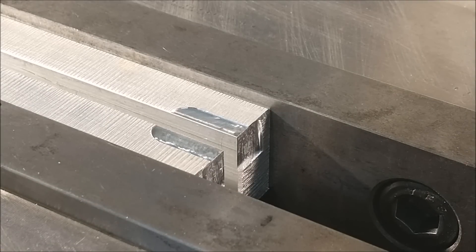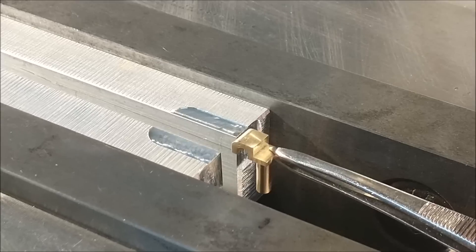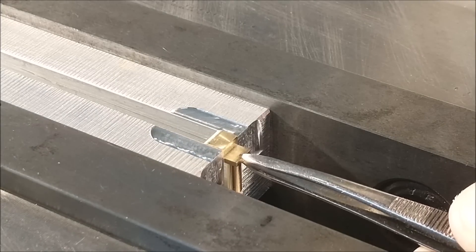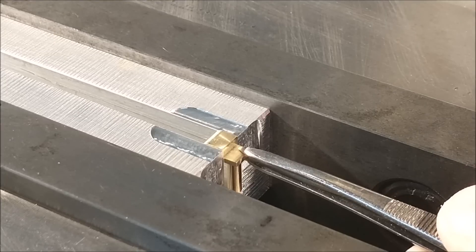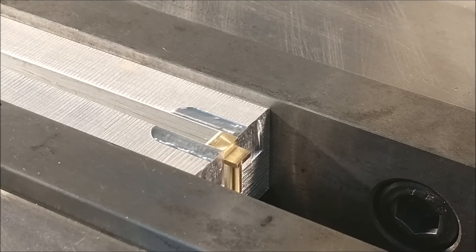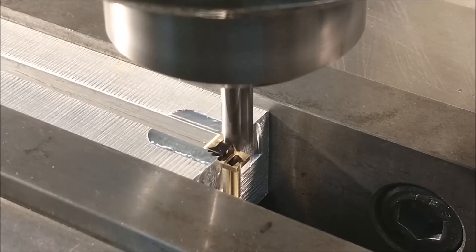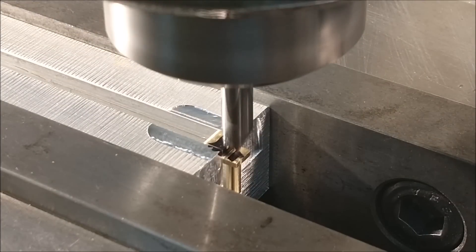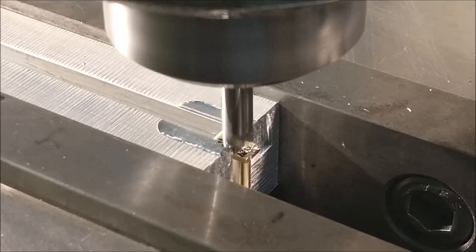This operation cannot be done on top of the jaws — all the work will be done below the top jaw surface. Using a pair of tweezers, I'm going to lay this piece in so the top and end of the part are exactly in line with those cuts in the aluminum jaws — at least one of the two blocks — so I know it's vertical. I'm also checking that the round section of the part is vertical relative to the cut surface. I'll black up the surfaces with a sharpie so I can see what I'm doing, then come in with the corner round tool to put the last feature on this part. I'm holding this with the most delicate grip, but I know I'm holding it tighter than the forces that tool will apply.